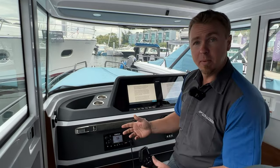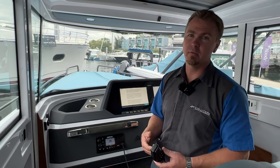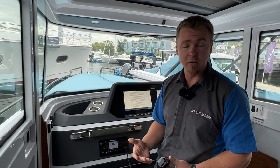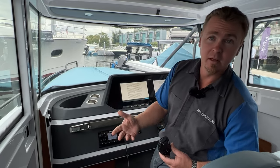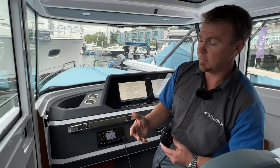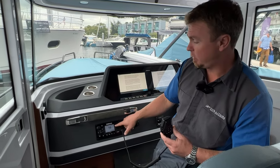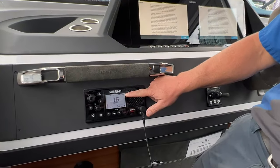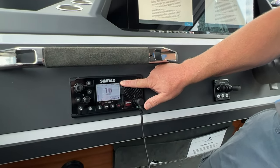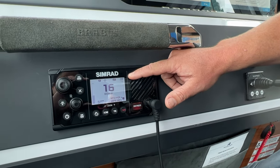The next thing I want to talk about are those frequency bands. As I said, we do set these up for the Canadian vessels, as we are in Canada right now. If you're watching this video outside of Canada, then hopefully yours has been set up correctly for the country that you are in. So let's take a quick look at this screen again, and we'll notice that up in the top right hand corner we have this little CAN up here. That basically is telling us that this particular radio is set to the Canadian frequency band.